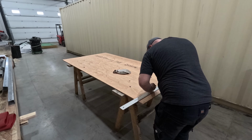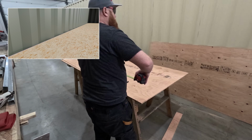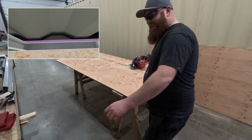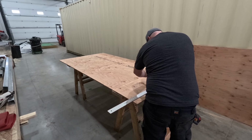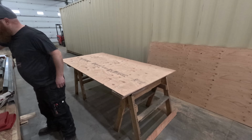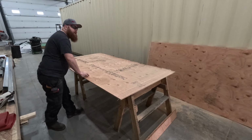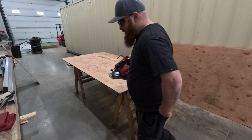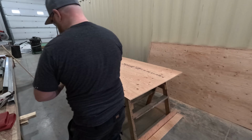With the plywood, we actually cut it to 7 foot 6 inches, which leaves an inch of foam exposed on either side. We used regular plywood here because we're going to be double layering our subfloor, and we figured it wouldn't be an issue, but we did notice some lippage between the non-tongue and groove plywood. So going forward, make sure you use tongue and groove at least on your first layer, even if you're planning on doing a subfloor on top of that before your finished floor covering.